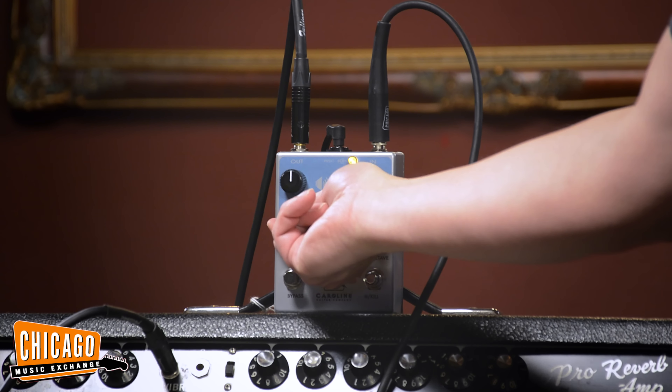There are two additional features inside this pedal. One is a gate/bias control, which if turned clockwise will allow the pedal to sound broken and really messed up in a cool Velcro-y fuzz kind of way — great for fuzz fanatics who want something different. The second feature is a lock feature that locks the octaving fuzz on all the time and converts the Havoc switch to a kill switch, so if you want it to be an octave fuzz all the time, you can activate that toggle and use the switch as a kill.